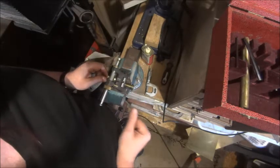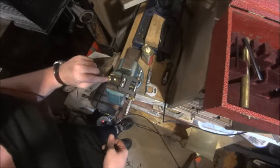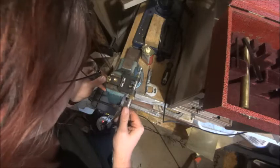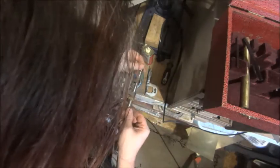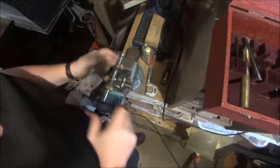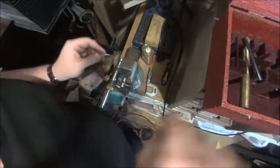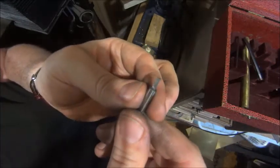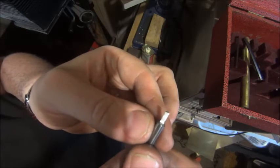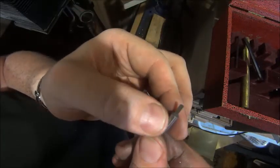The next job is to put a bit of an angle on one side. So we're going to turn this at 90 degrees - we've got on this side an indexer. If we lift this up and loosen that one off, we need to give it a bit of an angle, just some clearance to cut. It wants to clean up right across the front there and it doesn't want very much - it wants probably 5 degrees, something like that. And that should give us enough clearance. So if we slip that out of there we can have a look - there's a little bit of clearance that way, and it's a nice polished surface. That's what it should look like.